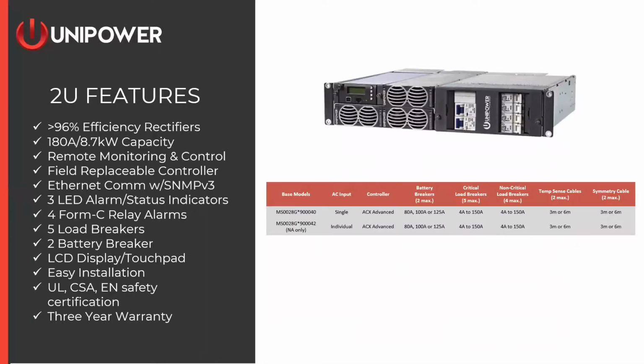Great, thank you, John. So some features that are common on these units are high efficiency rectifiers. The Guardian rectifiers are 96% or higher, up to 180 amps, depending on the shelf that you deploy here. They all have remote monitoring and control. So you can control the unit from the ACX controller on the front, or you can connect through our PALCOM system, which is a network system that allows you to control the unit remotely.